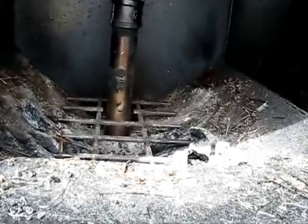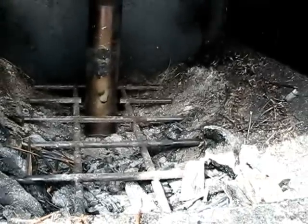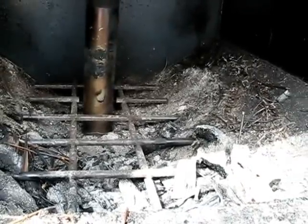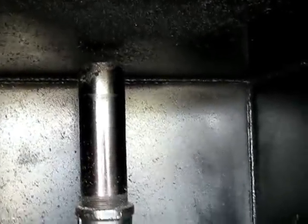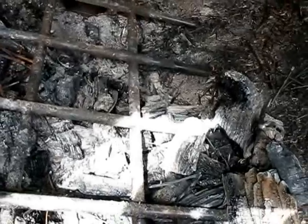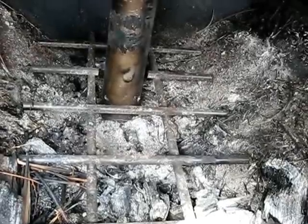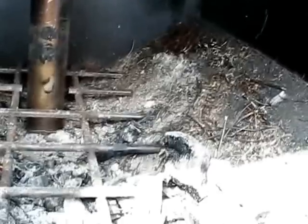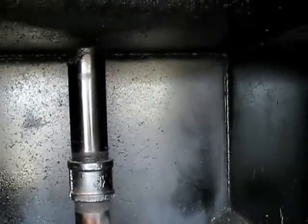I've done a few modifications. I found out originally with all my pipes and the exhaust going out the bottom, I wasn't getting enough air up through the wood to really burn very well. So what I've done is I've added this pipe — it goes from the bottom up to the top. I also removed all those other pipes. The holes just come directly in — there's two of them to blow fresh air in. I put a grate there to hold the wood up, and the primary burn works pretty good now. All the air comes in the bottom, burns the wood, and goes up and out the top.